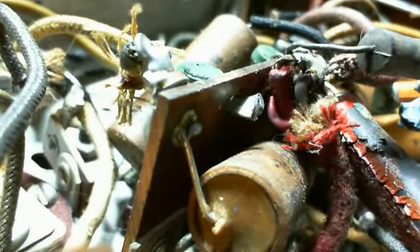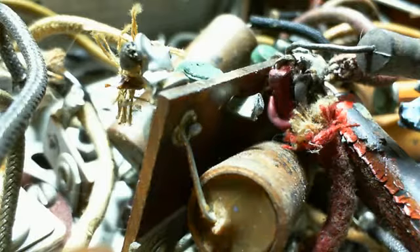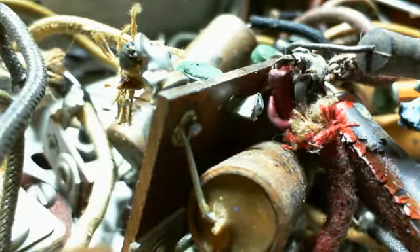These caps are 10s — only 10 microfarads. I would normally put a bigger capacitor in. 450 volts — pretty big. Because today's capacitor doesn't look that big. Let's compare: that's a 10, that's 450. This one's got five times the capacity at the same 450 volt rating. That dates these — puts them pretty old.